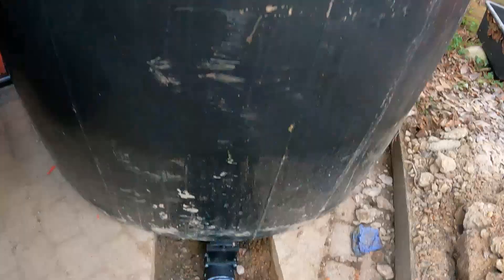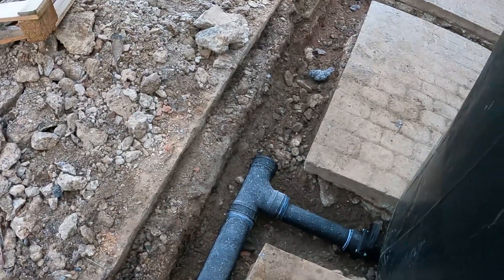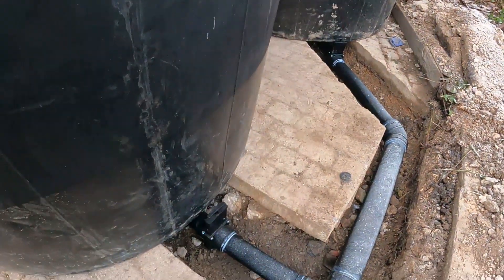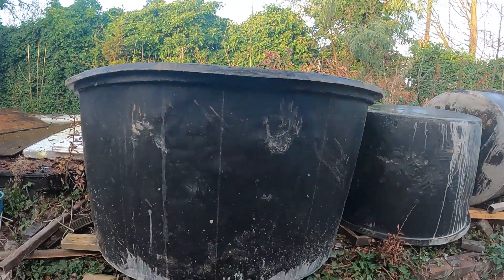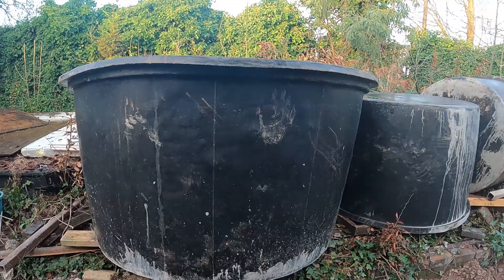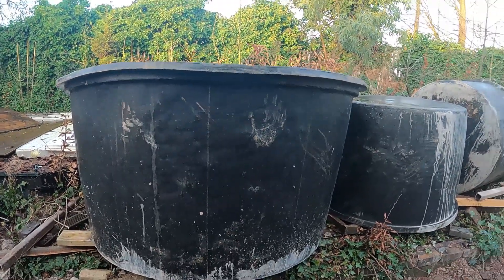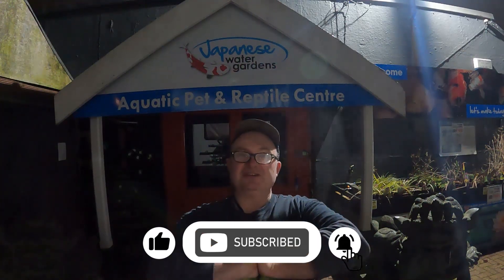Slide valves are on, got as far as here, ready to start connecting up the third tank. Completely flattened out that bottom, valves standing the right way round — more than pleased. We've got four of these 2,500 litre tanks. We're going to fit bottom drains into them, fit overflow skimmers into them, and run them into a DIY multi-stage gravity-fed filter. But you're going to have to wait until next week to see that.